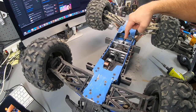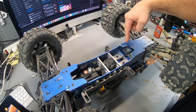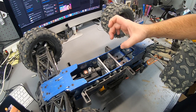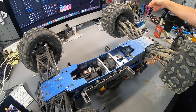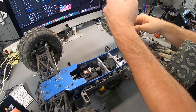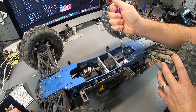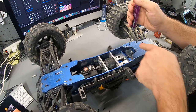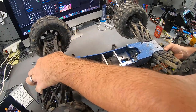I'm being facetiously funny, but kind of real. To move this motor it has three screws you need to crack — two motor screws right here for the motor plate, and then the screw on the back side for a little separate motor holder piece. I'm going to get my driver and crack these open. That's definitely loctited. Cracked, cracked — and cracked. Those screws are undone.